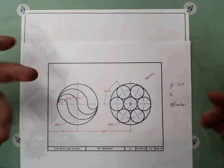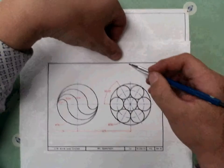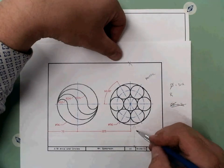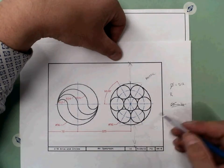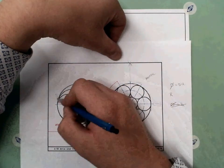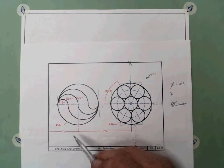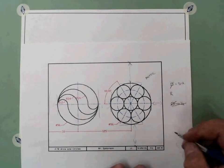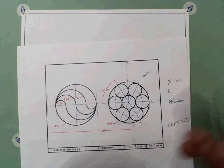But remember, all our drawings must be centered, meaning this space right here and this space right here, from that line and this line, they're the same. Same here. Here to here to here is all the same, right? Now, because they've given us measurements, we move them to those measurements. But if they don't give us measurements offsetting from the edge, then you must be centered.